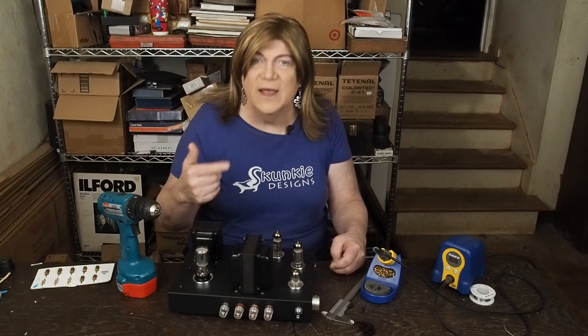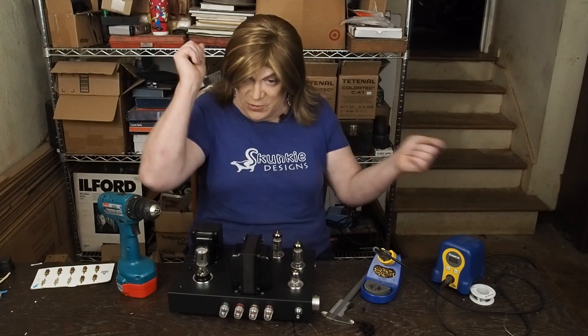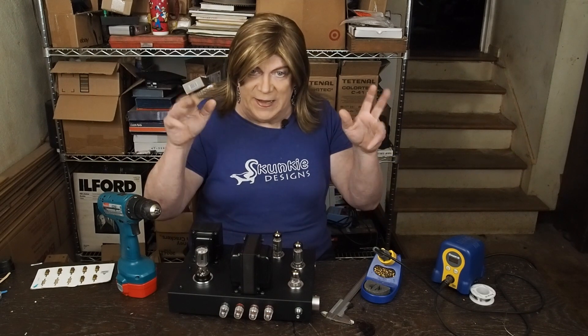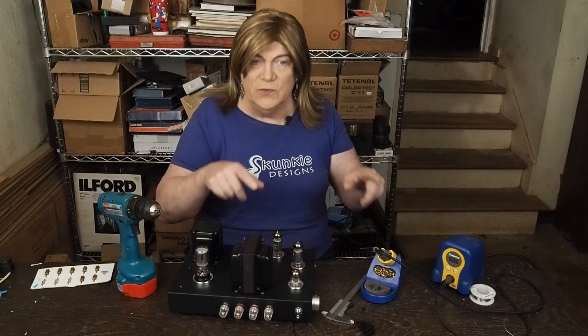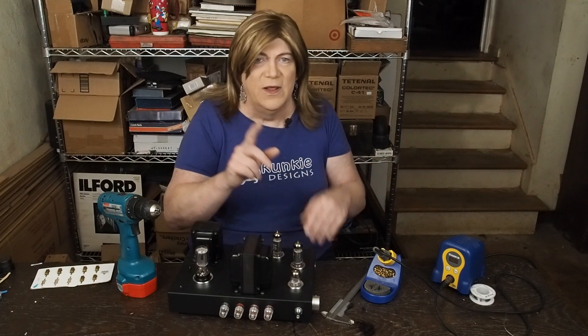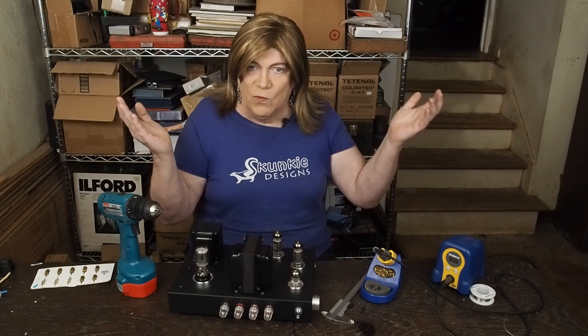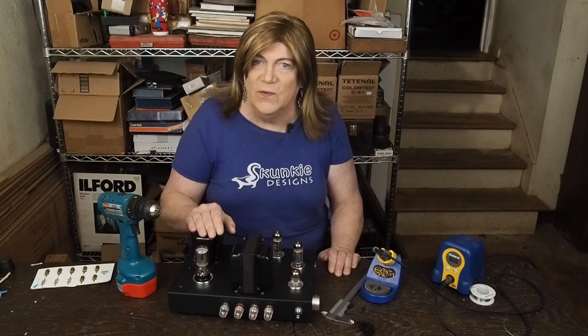When we started investigating his amp and looking at things, something made me think to get my voltmeter out and check the power at his outlet — and I freaked out. It was like, turn my amp off, holy crap, no wonder it smoked your amp. Being a cathode-biased amp — auto-bias — it was probably not going to melt down, but it's still not good to be running them at that high a voltage. Within 30 minutes the power company came out, they ran a new neutral wire up to his house, the voltages were all stabilized. We found the problem. I was glad I came over, because that would have been a nightmare trying to diagnose that amp at my house — I would have had no way of knowing he had 135 to 150 volts going into it.